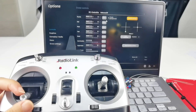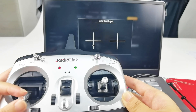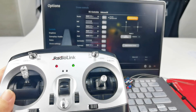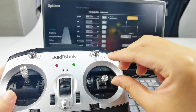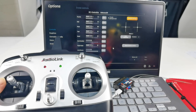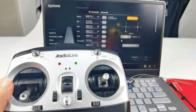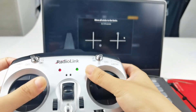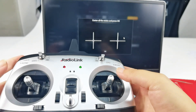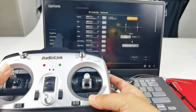Then we need to calibrate the joystick. Click Auto to calibrate each stick and follow the instructions — Throttle, then Roll, and so on. Pay attention: if the movement of the stick is opposite to the bar movement shown, please click Invert to modify the movement direction. Then click Stick Calibration, move all the sticks to their limits, center all the sticks, and press OK. Move the sticks and you can see they all work well, so stick calibration is done.